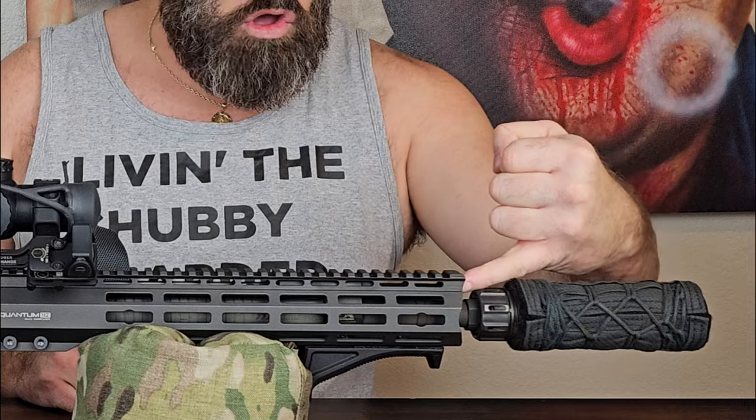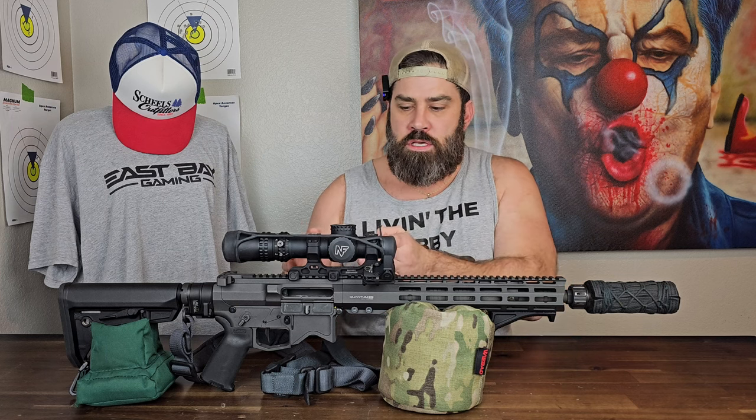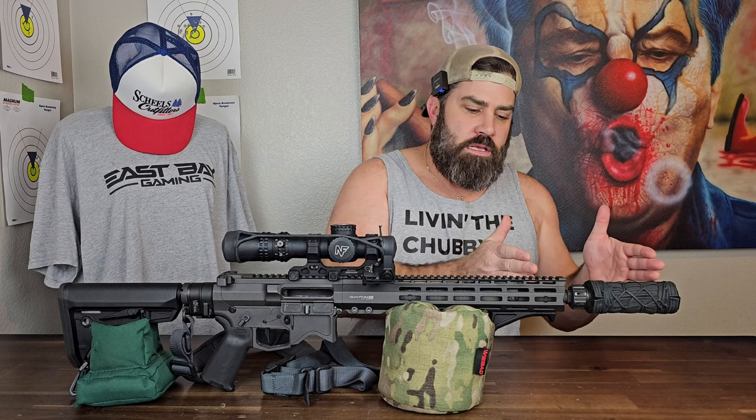After talking with Mr. Russo, he said tune the rifle for the suppressor, and I will carry the Allen key because it's very easy. The adjustable gas block is in here — all you do is put a long Allen key through the top here and rotate it. The clicks are very audible and tactile. So if I'm running this at 20 clicks out suppressed, and something happens to my suppressor and I need to take it off, I could just know I need to walk it back in more than 12 clicks — probably about 15 clicks, putting me only five clicks out from wide open. That's simple math; you can do that in less than 30 seconds. So that's not a major inconvenience — I will just put the Allen key in my kit if I have to bug out.